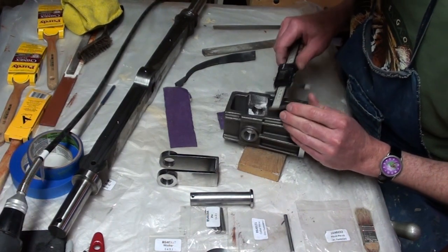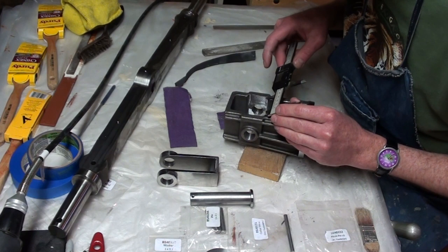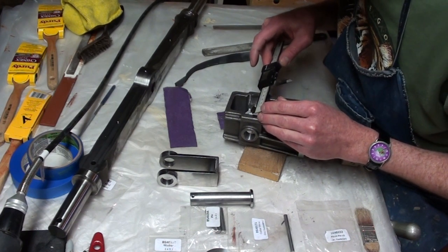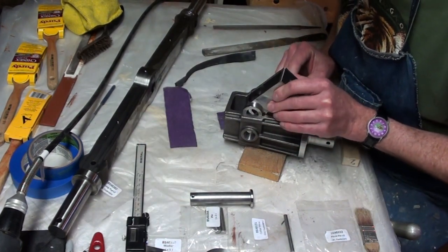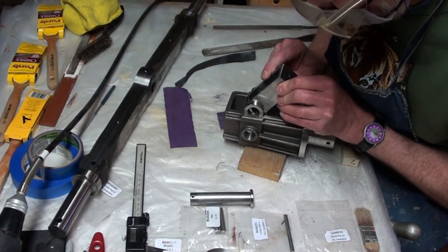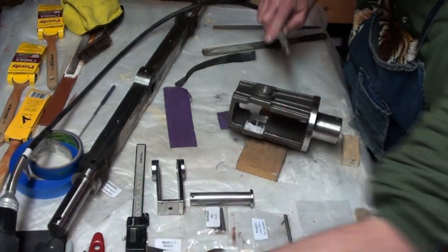A check of the spring hanger width and the mating opening in the pivot casting showed the space in the casting was undersized compared to our spring hanger width. We started by rough grinding the casting in the area of the pivot hole to enlarge the width of the casting close to the width of the spring hanger. A grinding bit in a flexible rotary tool worked well for this task. Once the size was close, we finished by filing and sanding to a smooth surface.